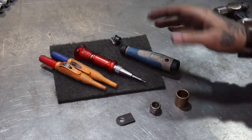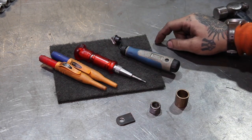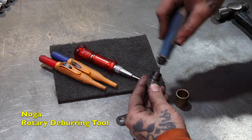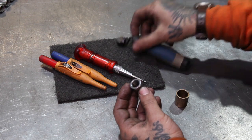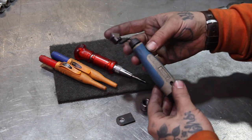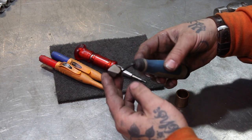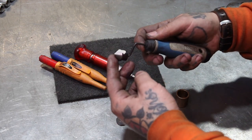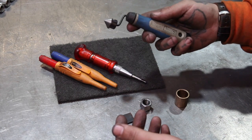These three I get questions about all the time, and I think that's because I pretty much use them in every video, every post — they're always in my apron so they're never too far away. I'll start off with the Noga tool. The neat thing about this is that it takes very little effort to use. You just pop it in a hole, give it a little swizzle, and you'll have a really nice 45-degree chamfer on the inside, taking off any nicks or burrs. The fact that this tool is available should pretty much mean that burrs on the backside of holes should never really be a thing. It's not super expensive and this handle has a quick release system with a whole bunch of different tips you can get for it.